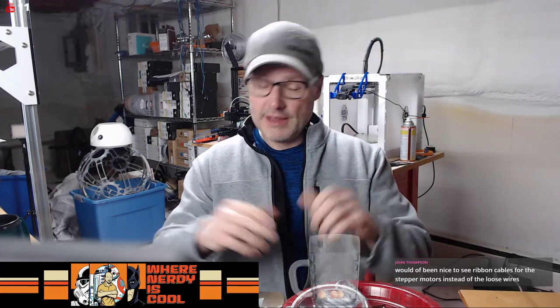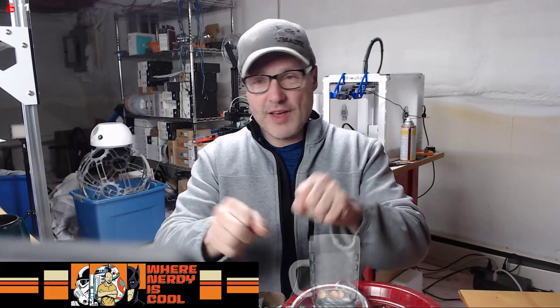Yeah, well, and to their credit, now they have these PCBs. Before, you had to do a lot of these couplers for the stepper wires. Not the worst thing ever. Quite frankly, I'm not scared of soldering. I would much rather have the kit say you need to solder this, or you can buy those solder sleeves. It's a little heat shrink tube with a little bit of solder in the middle. You put the wires in there, you hit it with a heat gun, and the whole thing shrinks up, the solder melts, and you've got a solid connection. Now, the con to that is if you ever have to undo that. So the fact that we're using a lot of connectors gives you the ability to unravel and undo things.